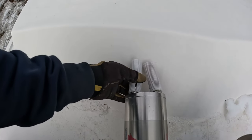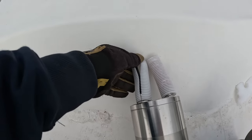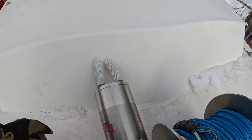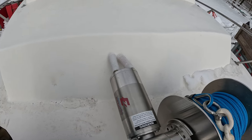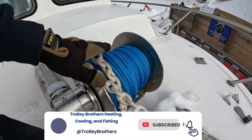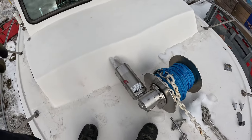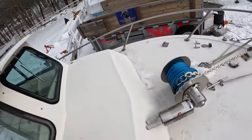Over here, some rather large wires — might be a little hard to see today, but basically those just go straight in and we have them sealed. I just took this kind of plastic tubing as a UV protector, just to kind of prolong the life and the cover of those wires. It goes up and down very simply — just up and down. Not a lot of things to worry about. You don't have to take any kind of lock, because it's a big motor on a worm drive. You'll know that you can't pull against a worm drive — you have to power it to move it.